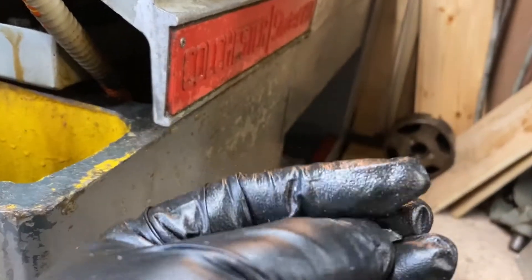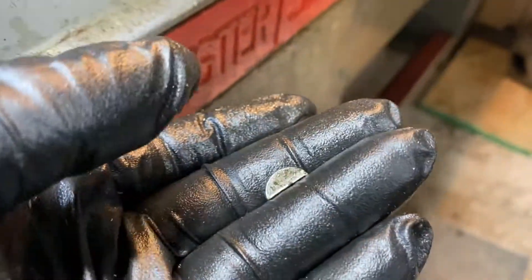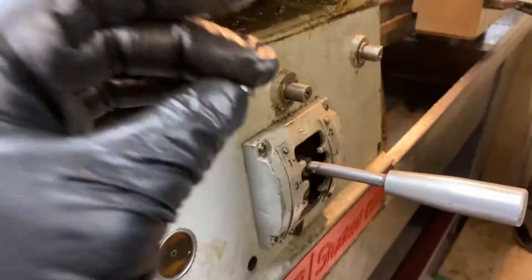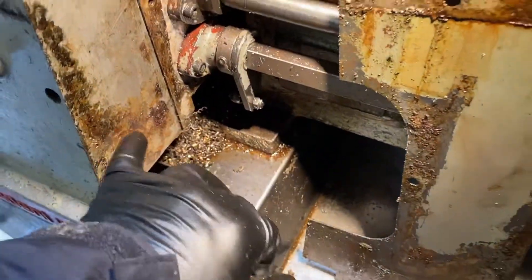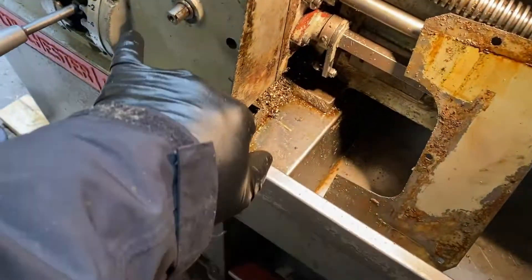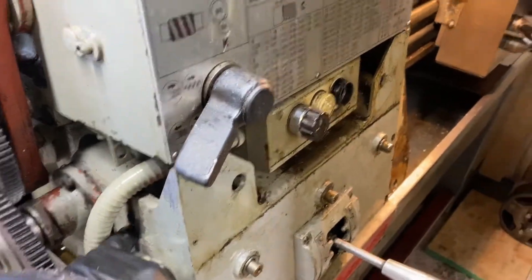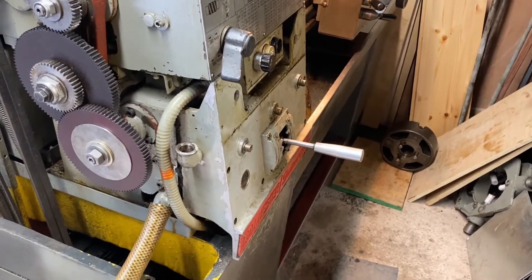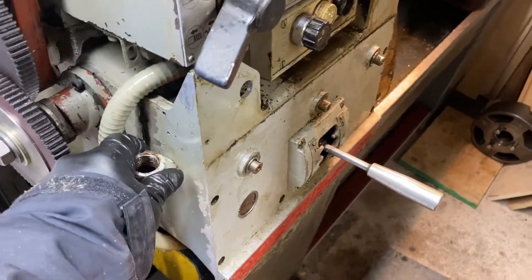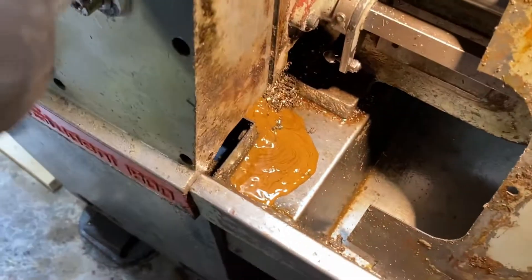You will have to drive out the little keys which sit in here because they won't go past the bushing, so you will have to just drive them out. Be careful you don't pop them off and have them fly off. There is another screw on that side plate to pop it off, and it splits along here. They are quite hard sometimes - they may have never been opened for 40 or 50 years. You do have to just be very gentle to pop them. As you can see, stuff is already coming out of this.